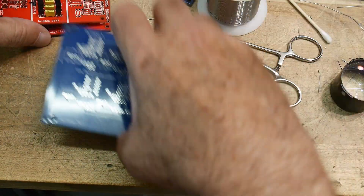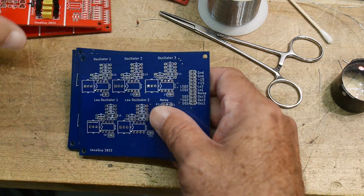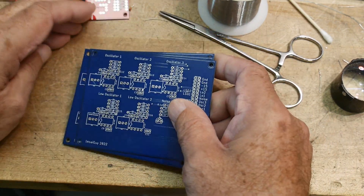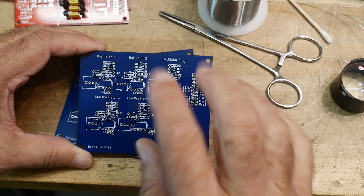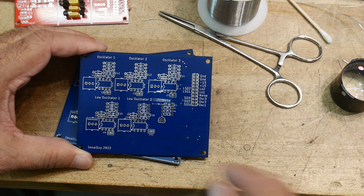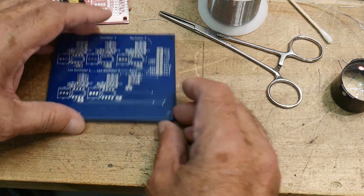In the mail I got the oscillator boards. Making them in different colors — I'll make those ones red, and I'm going to make this one blue. This one has three oscillators for audio tones, two low-frequency oscillators for modulation tones, and a noise source.